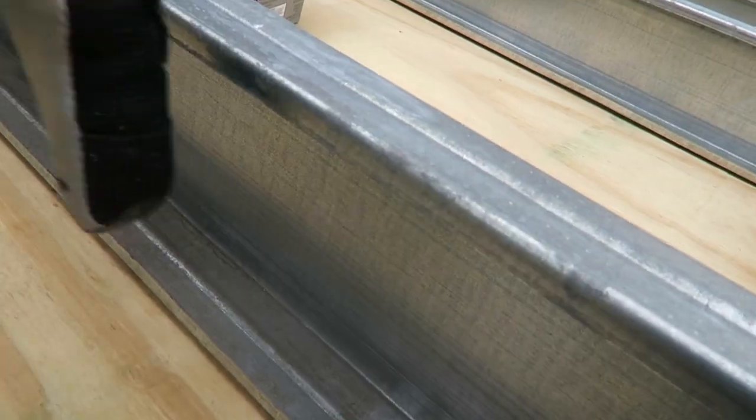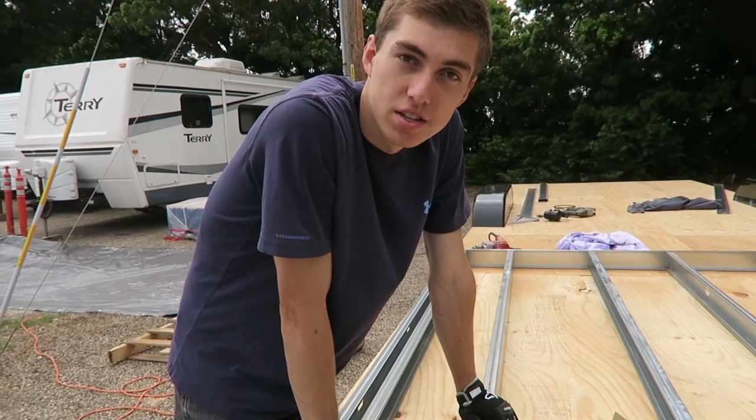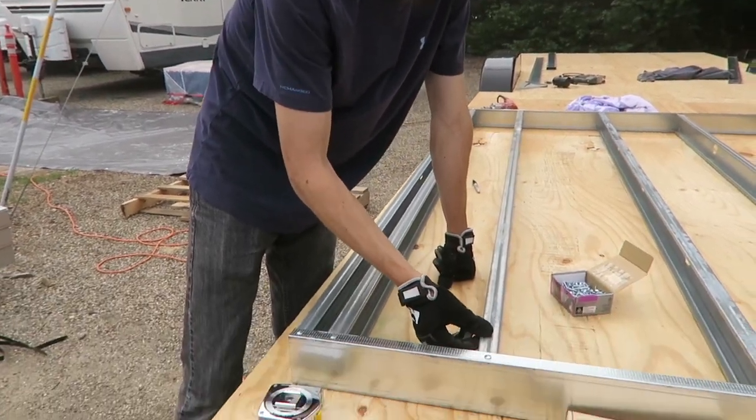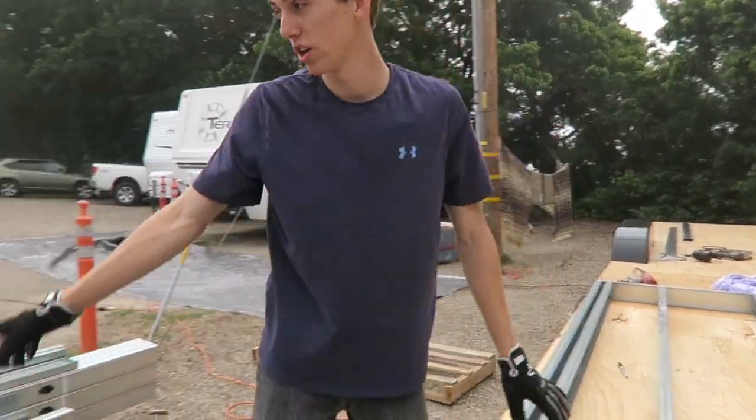That's what makes them structural studs, having not just the U-shape like the track, but that little flange there as well. So you want to make sure you have that. That's what's necessary for structural studs. I think these studs are manufactured by Semco, and they're all 33 mil thickness. That's how thick the metal is. 33 mil thickness is also 20 gauge. And we also got U-channel bracing.